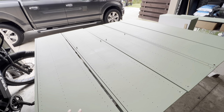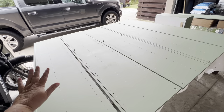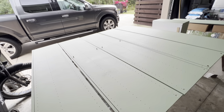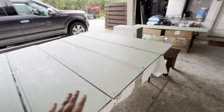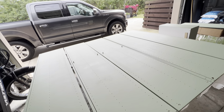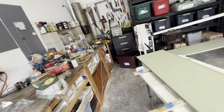I didn't do a proper how-to because we weren't sure this was going to work. What we did: we sanded the cabinets first — maybe a light-to-medium sand — then wiped them down to make sure there was no residue, then painted them. We didn't prime separately. We bought a special stain-blocking paint that has primer built in plus scuff defense. He nearly used the whole gallon on just the one base cabinet.